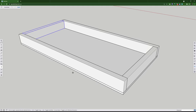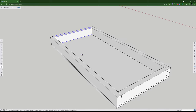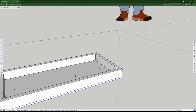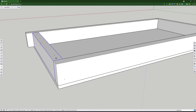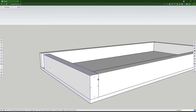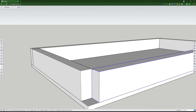I've got a frame — really simple joinery. I've got a butt joint there and a butt joint here. I can imagine some nails and a bit of glue up through here. There's a component missing, which is the middle bit. The reason I made my butt joints go this way — with the end piece backing up to the side piece — is so I can make the middle piece exactly the same. I cut three out instead of two. I'm going to move that end piece back — snap it into that corner — and snap the other one into that corner too.